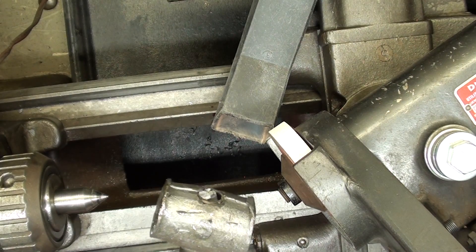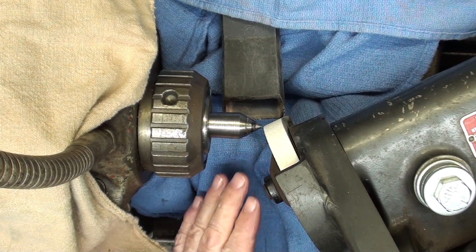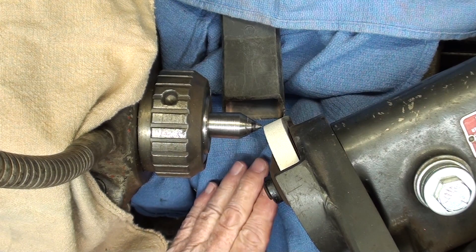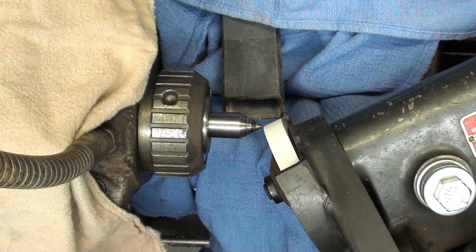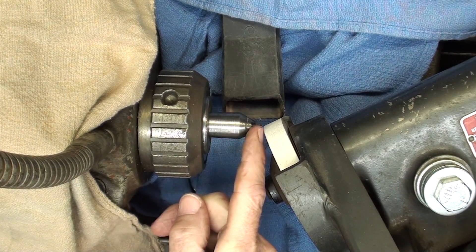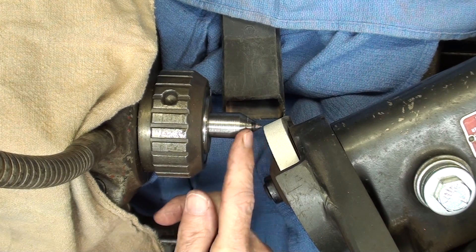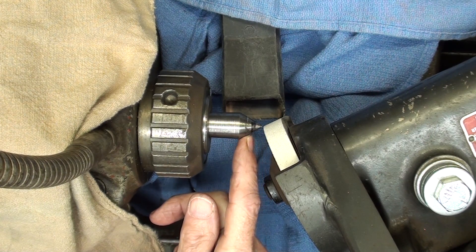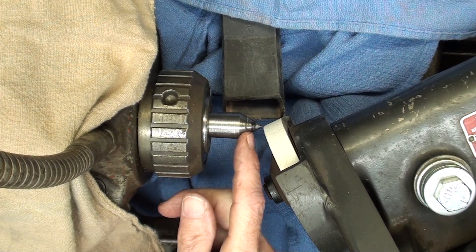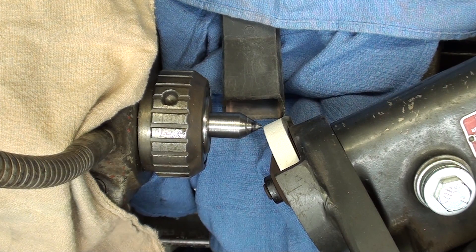Tap it into place. I've covered everything, and remember that the cloths are slightly damp in case there would be a fire. I've moved the grind wheel up close to the actual center. I'll put a little bit of dye or something on that so you can see it, although it's pretty bad now. You can see I've got the vacuum cleaner right underneath it — hopefully most of the grinding dust will just disappear.